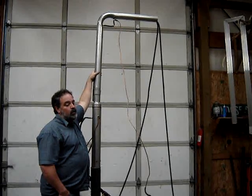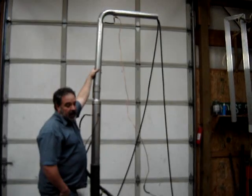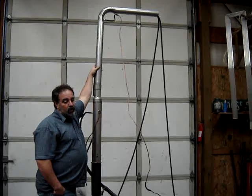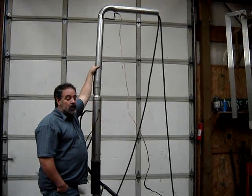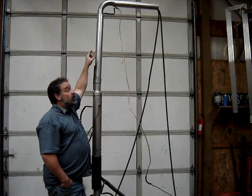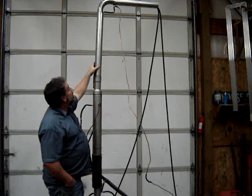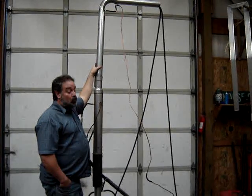You need to adjust it once per different batch of beer. So if you're running 10% today, you have to adjust a little bit. Tomorrow, if you're running 4% to try and get alcohol out of 4% waste beer, absolutely this will do the job. You have a little bit of adjustment one time for the run, and then it goes. Pretty proud of that little valve — it looks simple, but it works really neat.